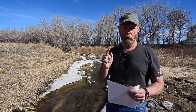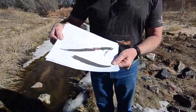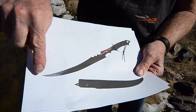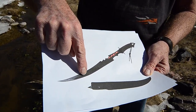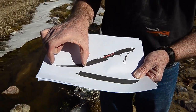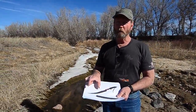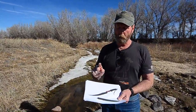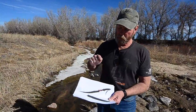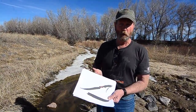This can sound a little funny, but you sharpen a curved or radius blade the exact same way you do a straight blade. Looking at this blade — it's probably 16 to 18 inches long — if you break that radius up into four to five inch pieces, it's actually basically a straight edge. I'm not sure exactly what trouble he's having, but this is a picture of the knife he sent that I'm supposed to address.